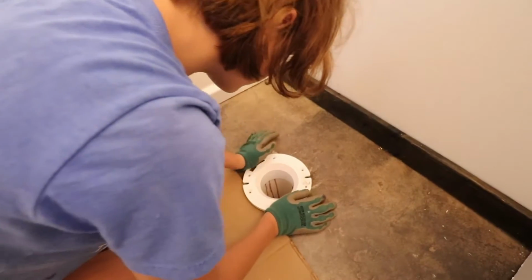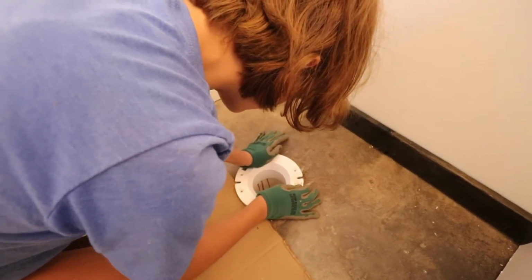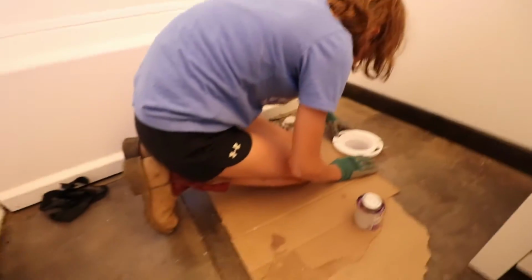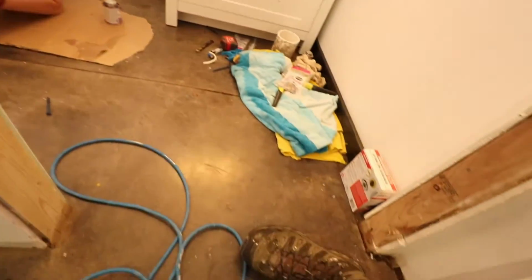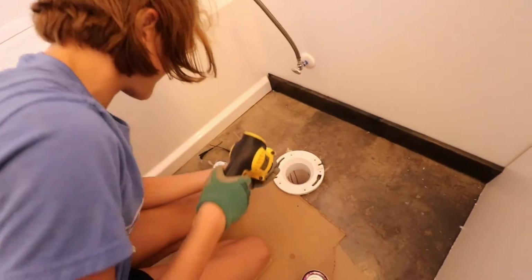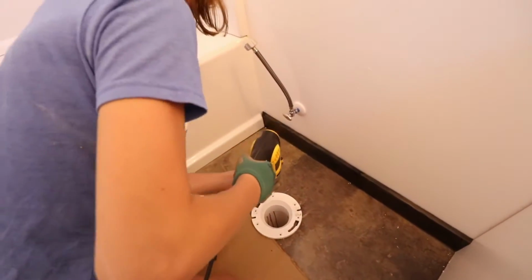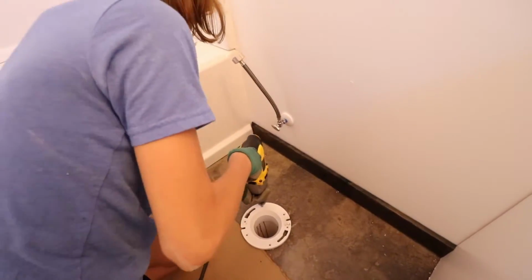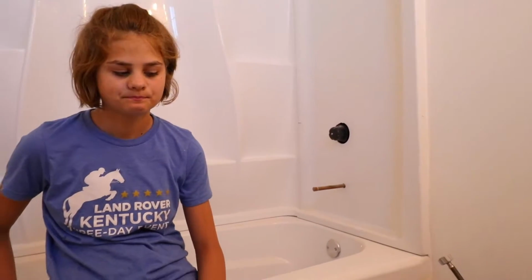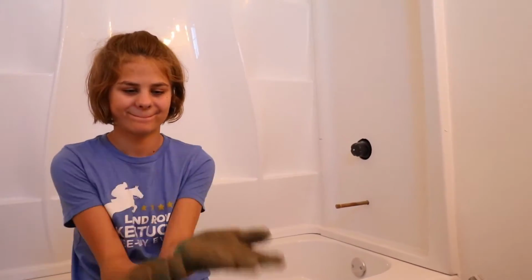All right. Think that lines up right? Stick the drill down the hole, since that drill bit fits through there, just to make sure. Did it go into the hole? All right, that's good. So now we gotta get those Tapcon screws down into the concrete in the holes you just drilled, okay? And you're gonna use this.